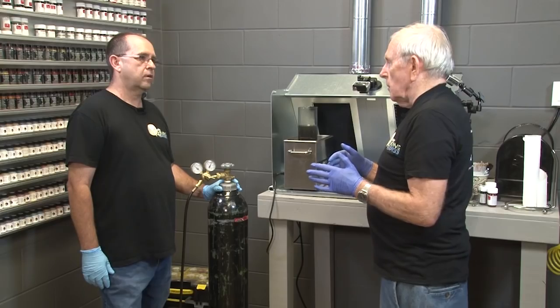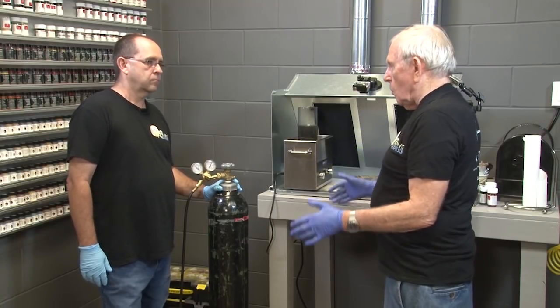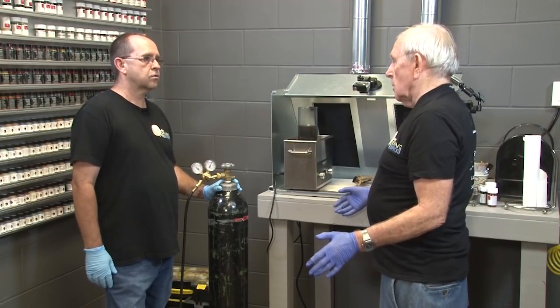don't buy one of these little oilless compressors that make you deaf when you run them. They're noisier than anything. I call those bilge pumps. Especially in a humid area. You can put water traps on there, but the humidity still gets through. If you're going to use a compressor, have one with a tank on it and a water trap where you can drain the water off. That's better than those little, I call them bilge pumps.